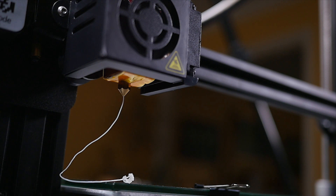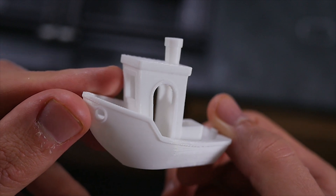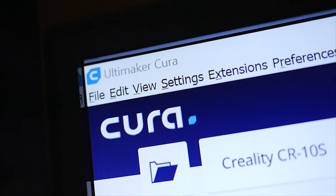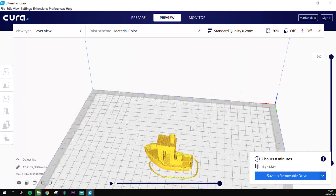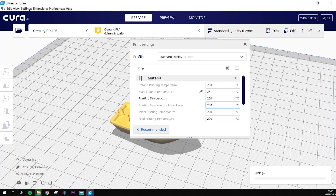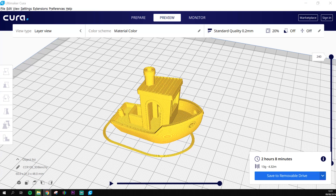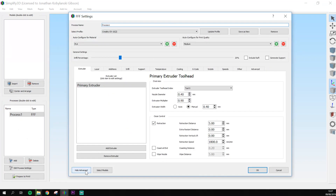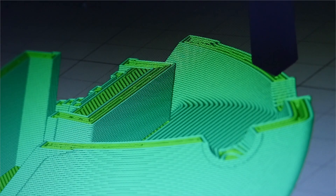I'm going to keep this as quick and simple as possible. I'm going to show you both Cura and Simplify 3D. To start, the model we'll be printing is the 3D Benchy as you'll learn the most from this print. Now that you have your file let's start with Cura — it's as simple as starting up the program, telling it which printer you have and then editing the settings. For PLA I like to use 210 for the first layer or 215, and for the bed I like to use a temperature between 60 and 70 depending on the ambient temperature. Once you're done in the prepare window, head over to preview and save it onto the micro SD. In Simplify 3D it's pretty much just the same — tell it that you're using a CR10S, drop in the Benchy, change any settings you want, so back to 210 and 70 or 60 for the bed, and then just save out the file.